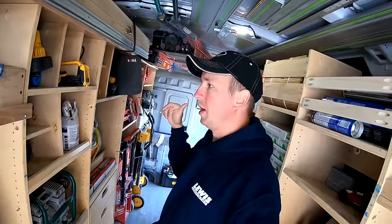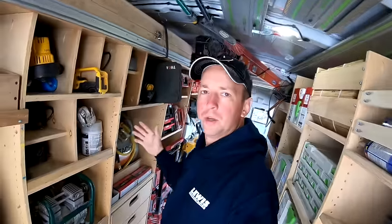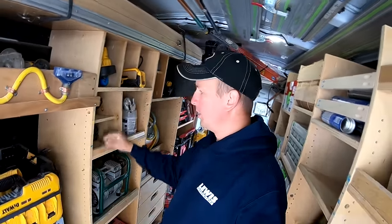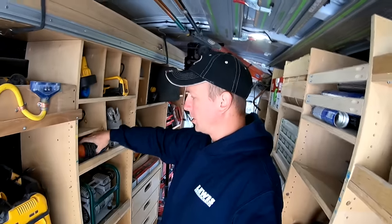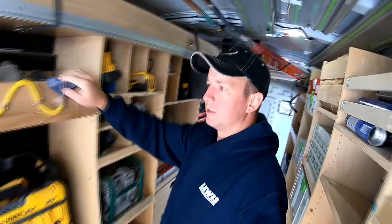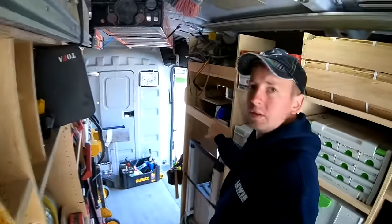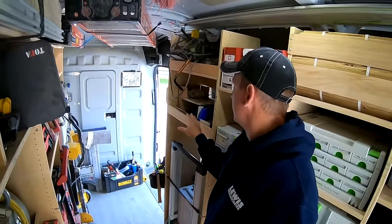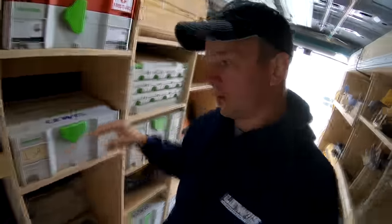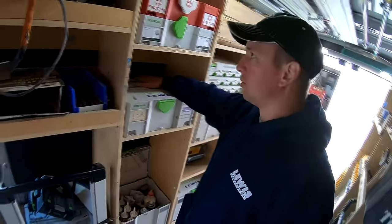Found that out many times, but it's a pretty good system that works well. The other thing you can implement is putting a nosing on the front edge of your shelf — that gives you a safeguard so stuff isn't going to fly out as easily. You can see here I've got a nosing on this shelf. And of course as I already mentioned, mortising a shelf works just fine even when it's flat.